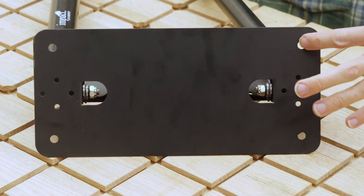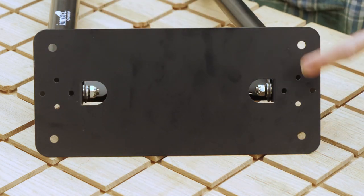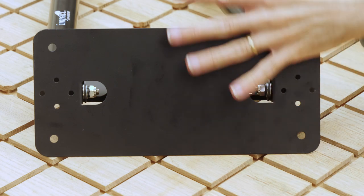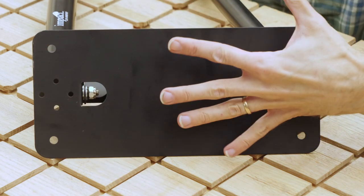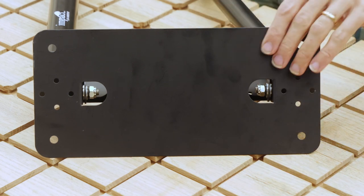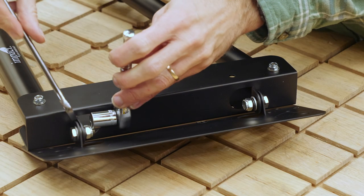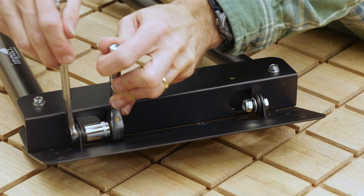This metal base plate has a bunch of different holes for mounting and what I'm going to do is enlarge these four large ones to make kind of a keyhole slot on each one so that I can set it over a set of four lag bolts and just slide it on and latch it in place. So I'm going to have to take this plate off from the boom arm and put it on my milling machine and mill out these slots into keyholes. I'll just loosen these two bolts that hold the bracket on and it should come right off.